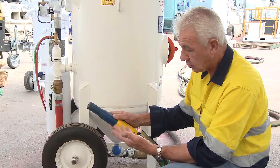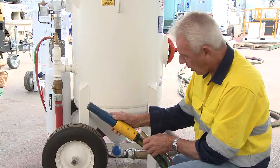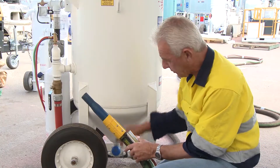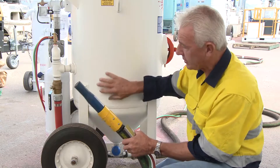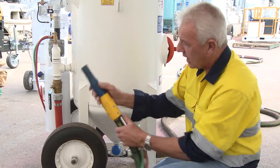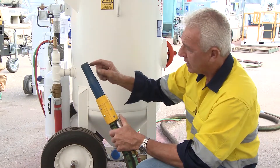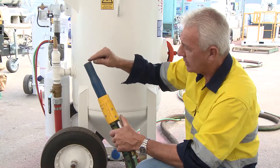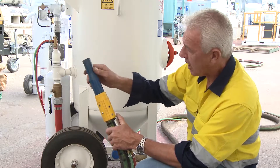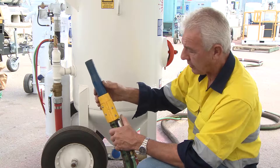But if you've got too much grit, you'll find that the spent grit looks like brand new — that tells you you've got too much grit. The easiest way to facilitate the appropriate metering of that valve is: if you've wound it out three and a half to four turns, bring the nozzle back to the blast pot, depress the safety pin, depress the dead man handle, and hold it up to the light and watch the grit exiting with the airstream. You'll find a mantle shape comes from the end of the blast nozzle, and if you hold it to the light appropriately, you'll see it's slightly blue — it has a blue tinge. That is absolutely spot on for the amount of grit you need.